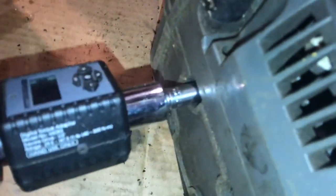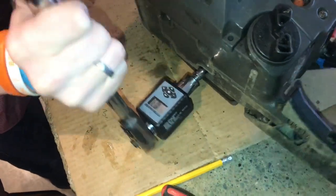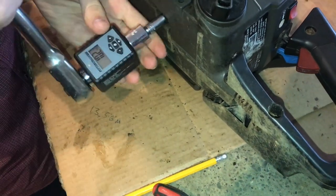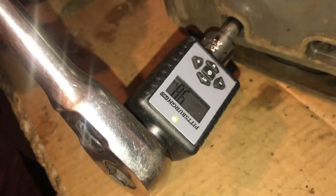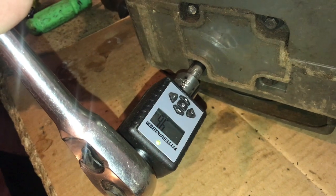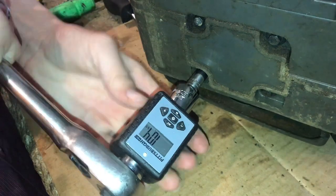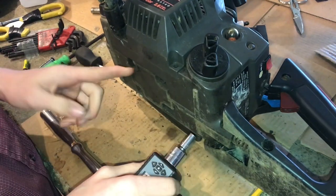You should hear a short beep. Right there is our torque — we'll move down to this one, then up to this one. Those short beeps mean we are within 20 percent of our targeted torque, and once we get to 10 foot-pounds — our targeted torque — it'll do a long beep. That long beep is what tells you your bolts are at your targeted torque and they are done.